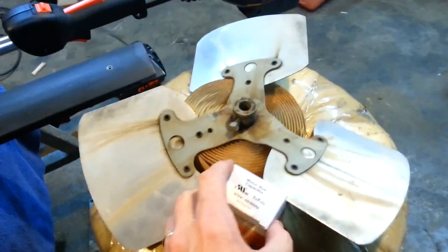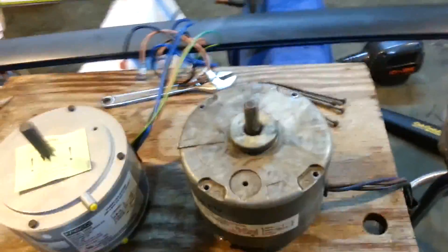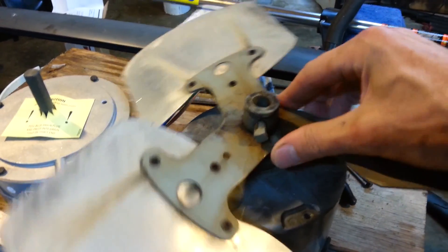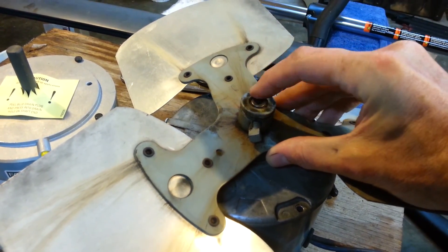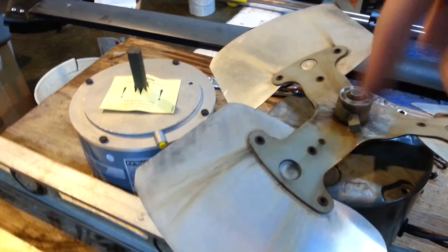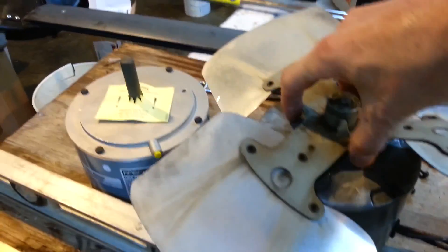You want to make sure of your fan position. When you first look at these motors you might think the shaft is longer, so when I removed the fan I made a note of its position — it was right at flush with the end of the shaft. Always make a note of your fan position when you remove it, because it can be pretty critical if you're a little high or a little low. The ductwork around it will affect your airflow, and if you get the fan too high or too low you won't pull as much air through the coil, which kills your efficiency.